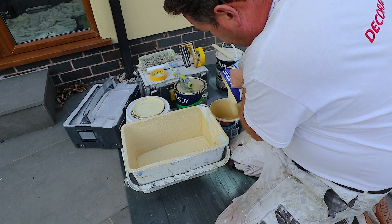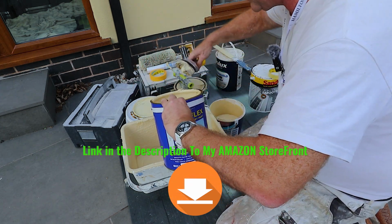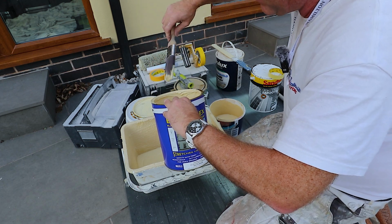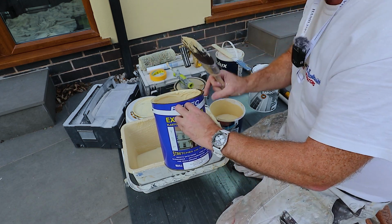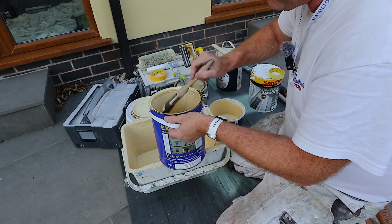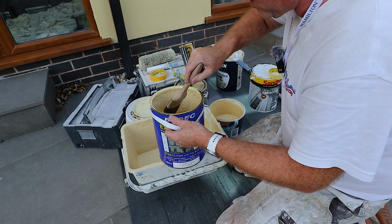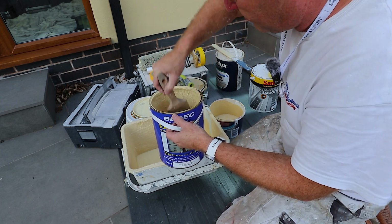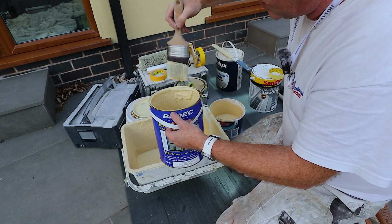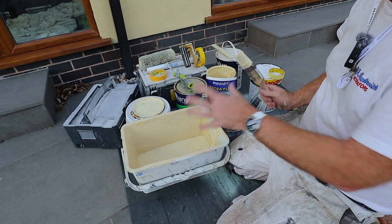Now, I will say to you, as I did in the previous videos, if you have lichen or mould or algae over the surface of your brickwork, your render, whatever you're going to be painting, make sure you sort that out and use a proper fungicidal wash. That's what I did on my original video of this series. I used the Dulux Trade Weather Shield fungicidal wash. I treated the algae and the bits and pieces that were on there, brushing it on, giving plenty of solution to that area, and then you wash it off the next day. So if you've got the same sort of thing, make sure you do it.